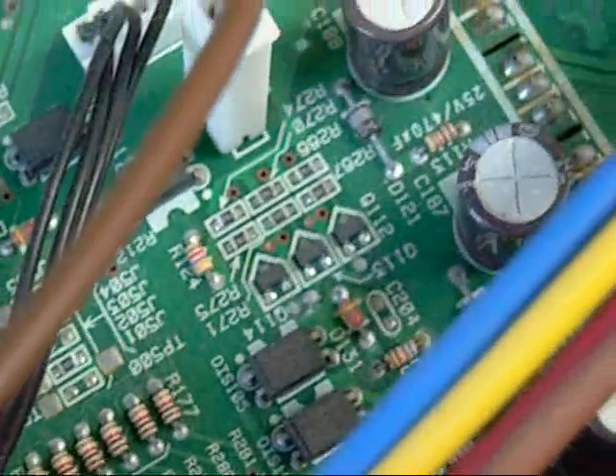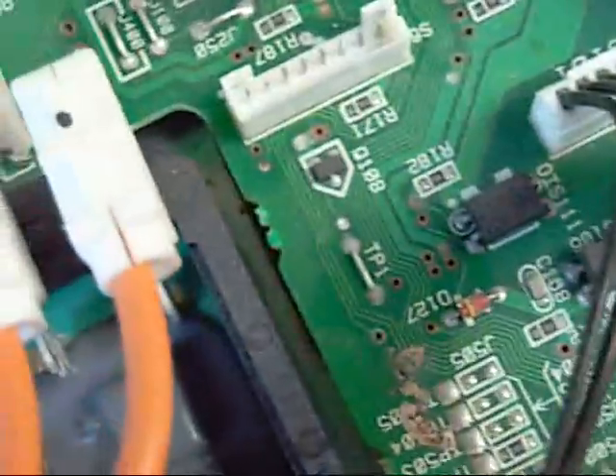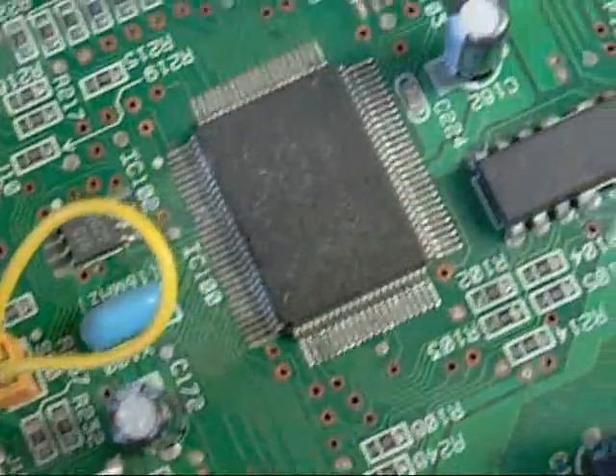I'll lift this one out next and just see what's going on on the underside of it. The only problem is I've got to undo these packs and break the heat sink seal, and I don't have any heat sink paste so I can't really do much with it until I get some. Still a lot of evidence of moisture and critters getting into it - I might have covered this one in a light spray of epoxy or something but it hasn't worked. I can still see oxide on some of the component legs.